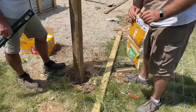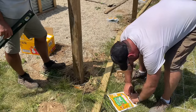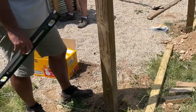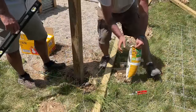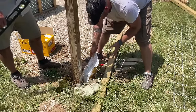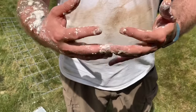Here's where the first lesson is learned. It was hot out — the middle of summer — and the foam had been sitting in the sun for a little bit. That changes the reaction time, so when I started mixing everything up and doing the 15-count before cutting it open, it started to expand and explode on me. So when it says you should wear gloves, eye protection, and a mask, they are not kidding — this thing exploded all over me.